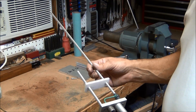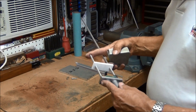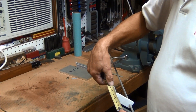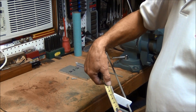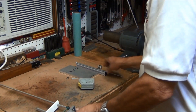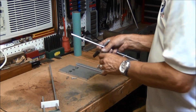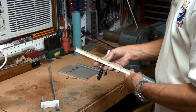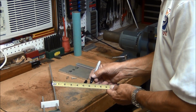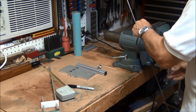I'm going to copy this design and I have some aluminum rod and aluminum stock to make it out of. The first thing I'm going to do is cut these rods. The first rod is just over 6 inches, and the other length is going to be 20 and 5 sixteenths inches.